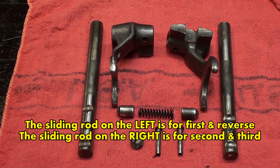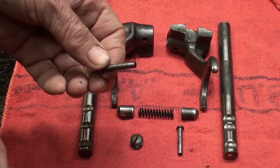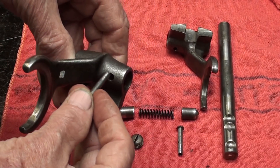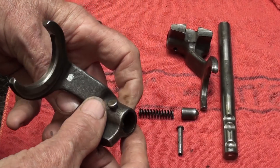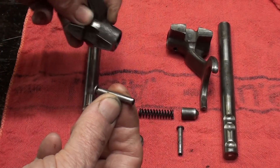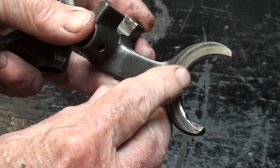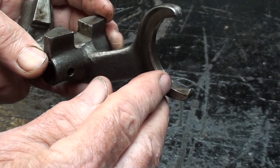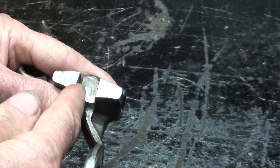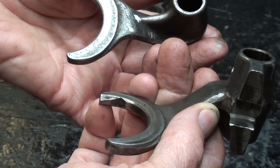All of the tower parts have been cleaned and prepped and ready to reinstall. Now on these two rivets here, I put them on the lathe and cleaned them up so that they will very easily slip into the holes — I don't have to fight with them. You may have ruined those when you took yours apart and have to make some rivets or pins; you won't find these at a store. These forks are in pretty good condition, but there is wear. You can see it here, and a notch right here which should not be in there — this should be perfectly semi-circular. And these slots here are quite a bit wider than what they should be, but very usable, especially just for a cutaway model.